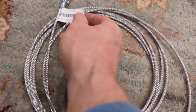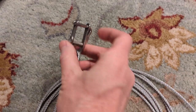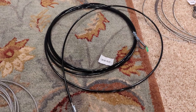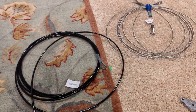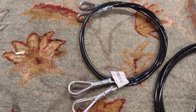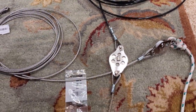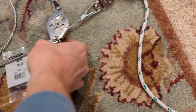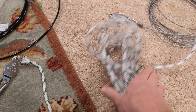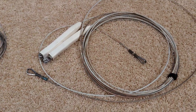New jib halyard from Murray's has a quick-attach, which is really nice. The regular forestay is actually coated now, which is kind of cool. Both the new bridles are 5/32 bridles — so a little bit bigger — and will match the upper forestay. I'll reuse the line; it looks like it's in good enough condition. Next up will be the shrouds.